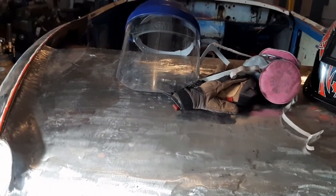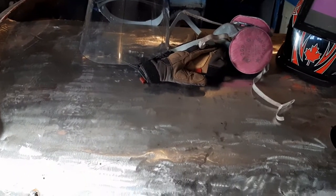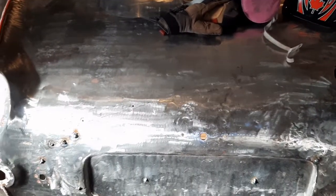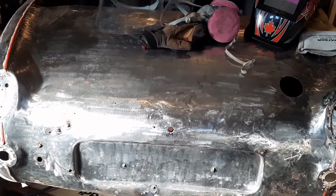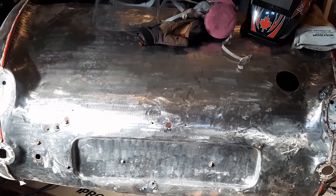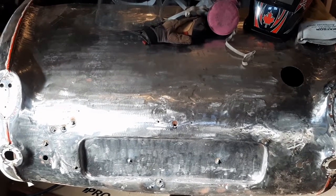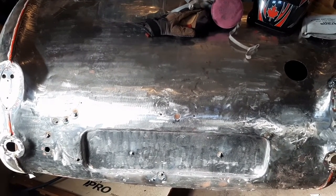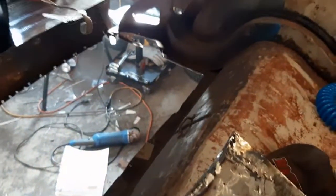I've got to obviously degrease them first, because that's always the first step. Then, in my case, I've got some POR15 metal etch, which puts a zinc coating on it and allows you to weld through it. That'll go on. Then the POR15 rust prevention paint, right up to, but a little bit shy of the seam, so I'm not welding through the paint. And then once that's in, the back sides of both of them are going to get POR15'd. Then it's all going to go on.